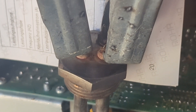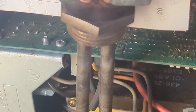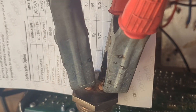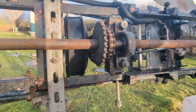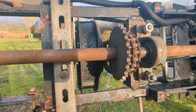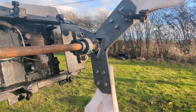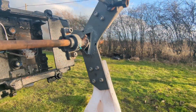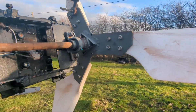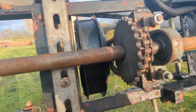The output of the turbine now has the jump leads connected straight to the dump load, so that when the turbine is attempted to be spun by hand it should be difficult. But I was interested to know just how difficult. I've got to say it doesn't seem to make much difference. So that's good because that means theoretically it can just be left on to the dump load, and if there's enough wind — 8 or 10 miles an hour — it should get going.